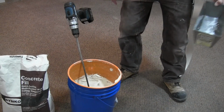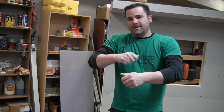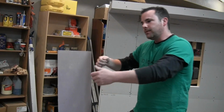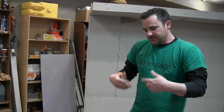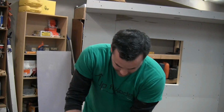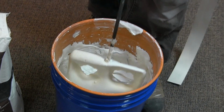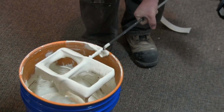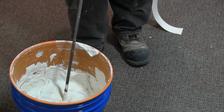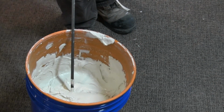And same when you're applying your tapes, the more moist it is, when you apply it to your drywall, it dries it out as you go. So the more you're applying tape, you're wiping it out. It dries out a bit and you mix it in with old mud, right? So it just gives you a little more allowance because it is moist. Now if it was dry, it's only going to get drier. So let's just try this. That looks really good. It's not quite dripping all over the place, so it's not like water, but I can tell that it's going to flow nice. And I always make sure that I scrape this mud that's on the walls of my bucket, and I scrape it down and keep it low so it doesn't get crusties either.